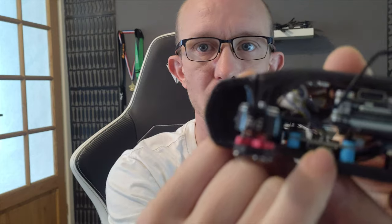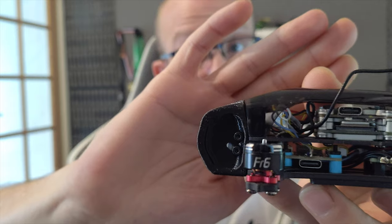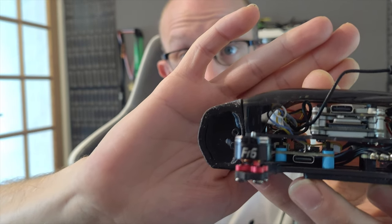I presume the flight controller is already set up for the DJI controller, because when you go to buy it there's no option to have it come with Crossfire. However, in the instructions it does tell you that you can fit an external receiver — you just cut off the S-Bus wire from the Vista and wire in 5V off the flight controller just above the USB-C. There's a little 5V out and a UART broken out. So I've run the 5V into my Crossfire and cut the S-Bus pad off the Vista and wired that into the Crossfire.